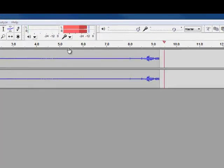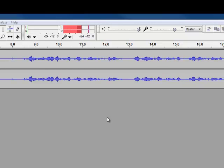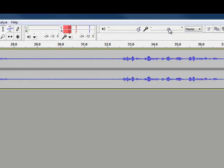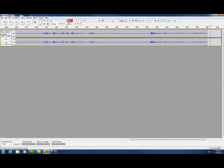If you notice the signal in Audacity maxing out by going over these blue lines, or if you notice the lights hitting the red zone of the green and red lights on the mixer, you're maxing out the signal and the sound will clip and become unlistenable. When this happens, slide the input volume down here by the little microphone in Audacity. Now Audacity will receive less of the signal from the Otari. You should hear the change reflected through the headphones.